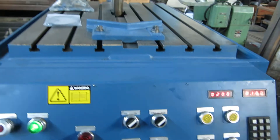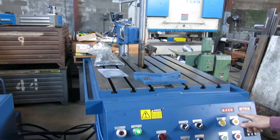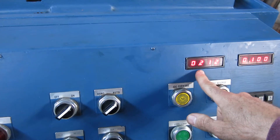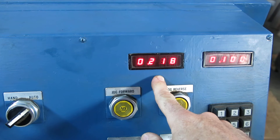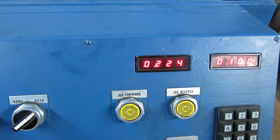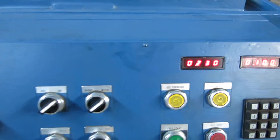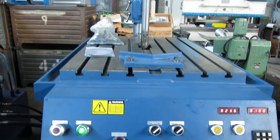Ram start, feed start. If you look over here, this is the feed in from your program of how much you jump in. So we'll add 100 to the 200, and we should stop at three hundred thousandths. We're feeding at six thousandths per stroke right now, but we can change it to four thousandths per stroke.